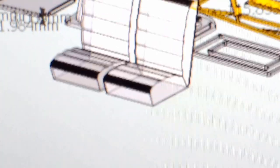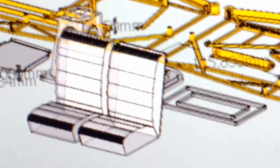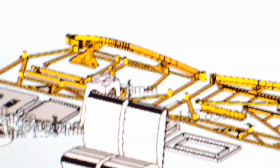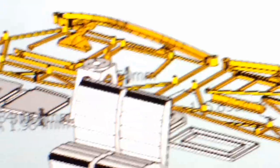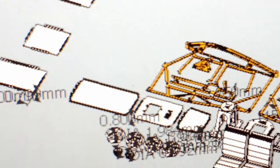If we do an X-ray view of that seat, you'll find the wall thickness is a lot thinner on the right one than the left — the weight saving is almost half, although they look very much the same. I do the same with all the parts. My first prototype is typically not the last — I go through three iterations before I'm satisfied and call it a final part. This is how I work all my designs. I don't employ full wings with a lot of ribs — it's not necessary when you design for lightweight models.